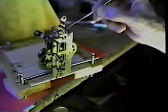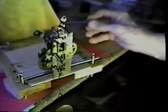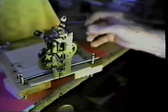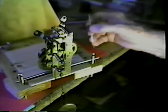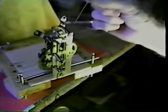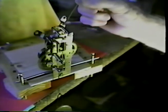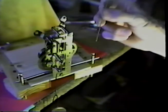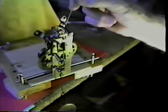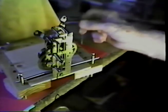One of the things that I frequently do is coat the area that's to be heat treated with silver soldering flux. I use a white cream-like flux, which is really powdered borax and water, and you place the flux on the steel and bring the heat up quite slowly so that the moisture that's in it evaporates and does not blow the flux off of the surface. If you heat it too rapidly, the water boils, and that blows the flux from the surface, and it'll leave some spots of fire scale.